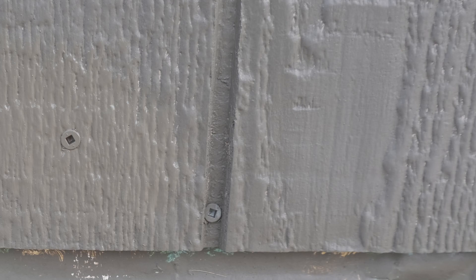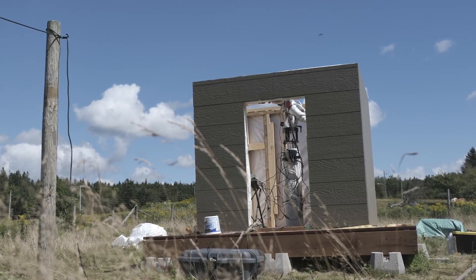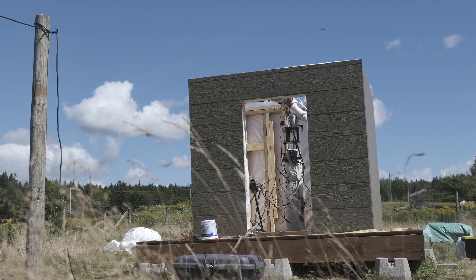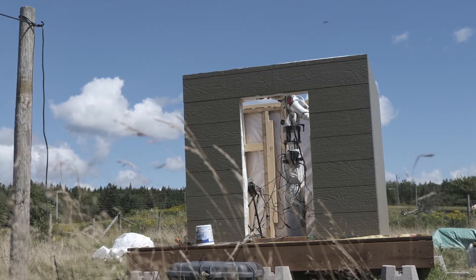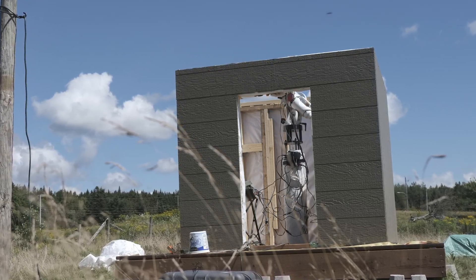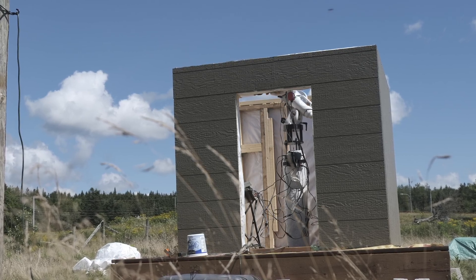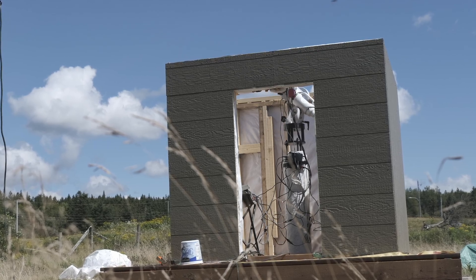The lateral strength is their ability to resist the wind. There's not supposed to be a lot of wind coming with the storm — about 50-kilometer gusts, that's about 35 miles per hour. It's still strong, but not hurricane force. As the final step to reinforcing those walls, this weekend I'll install some foam silverboard insulation, put vapor seal on the inside, and then fasten OSB inner walls to the walls. This is to slow down temperature changes and minimize condensation inside the observatory when the roof is shut, but the additional OSB fastened to the inner side of the walls should triple their lateral strength.